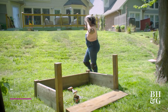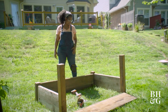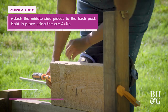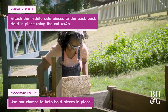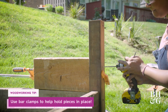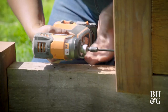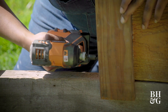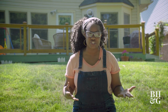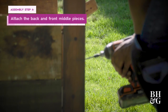This is actually a pretty good size — it's different when you see it in your head versus when you see it in person. Now it's time to add the middle sides to the raised planter. We're going to do that by attaching each side to the back post and then putting in place one of the four top and middle posts that we cut earlier. Putting this raised bed garden together is sort of like building a log cabin — there's a lot of old wood with a lot of weird shapes. Now I'm going to go in and add the end, middle, and front.